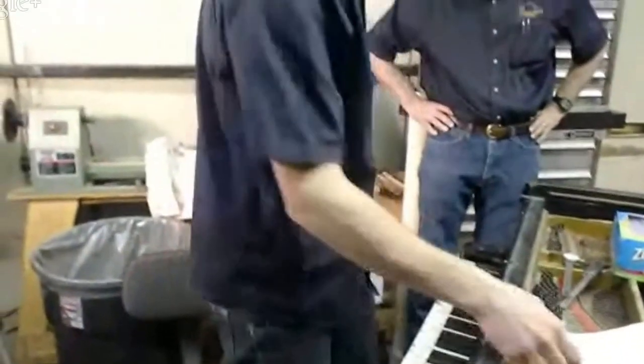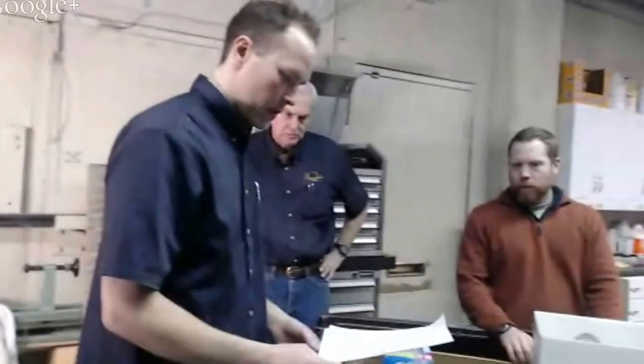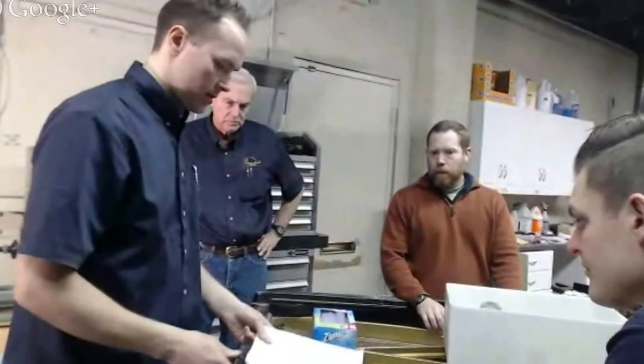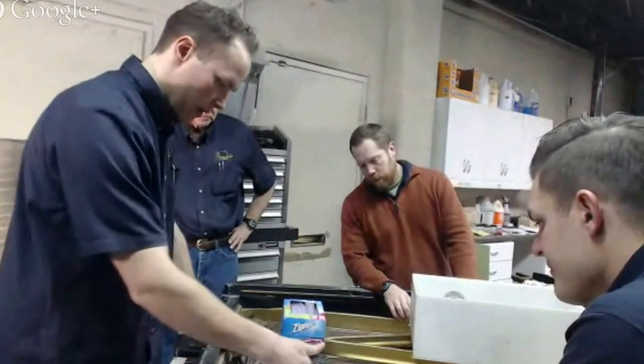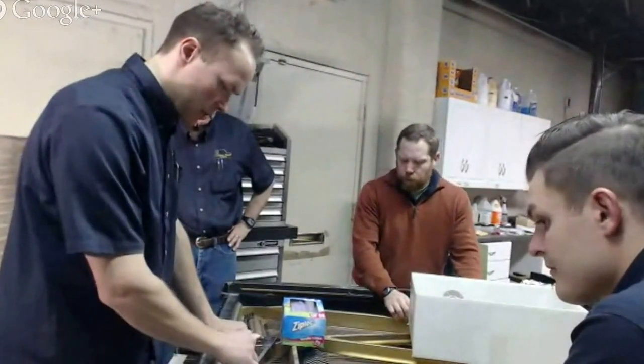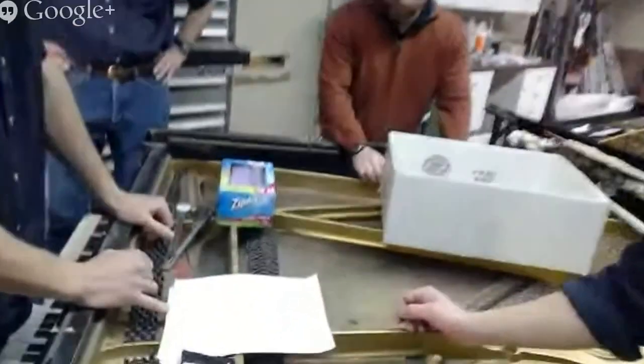And then this is something we'll be filling out. This is a piano that I did about a year ago. It was just a box that I grabbed. I still haven't emptied it out. Just to give you an idea, we've got all these measurements. On this particular piano, I didn't take the bearing measurements, it looks like. I've got all these felt configuration and shared hitch pins and tied strings. Note 29, note 64, old tuning pin, all of them. So we're going to be throwing that on this too.